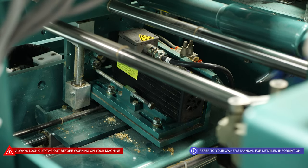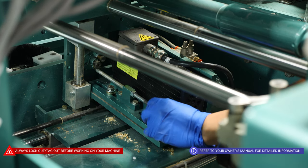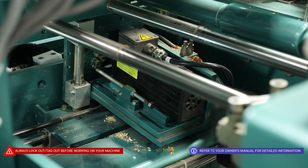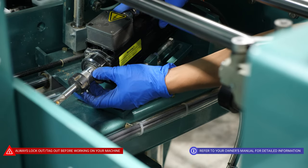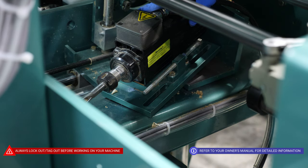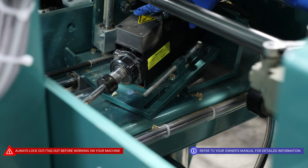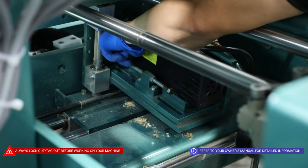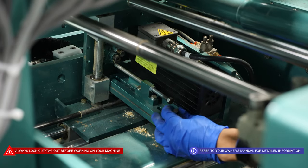When it's time to change out your faceplate router, you want to loosen these bolts and completely take them out — size 9/16. Grab your router and bring it out. Take your tooling, hold here, loosen that collar, take your old tooling out, and bring your new tool in. A crucial piece of this is you'll want the bit sticking out 52 millimeters from the collar to the top. It doesn't have to be exact, but a neighborhood number is very nice. The reason for that is so it clears this plate right here. Simply put your tooling back and reassemble, retighten your bolts.